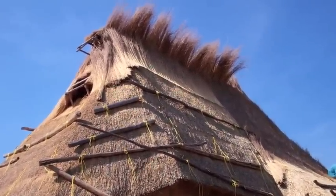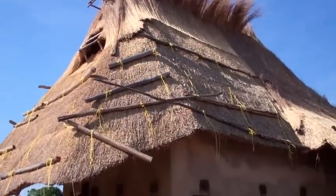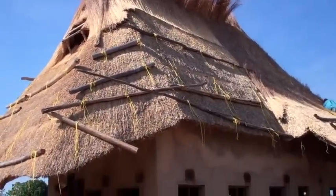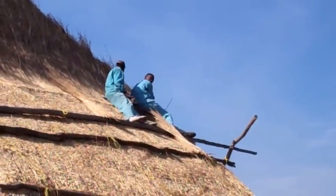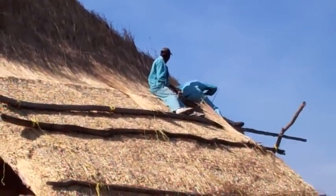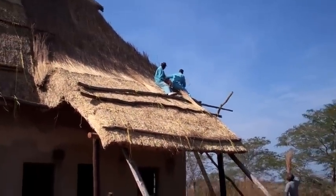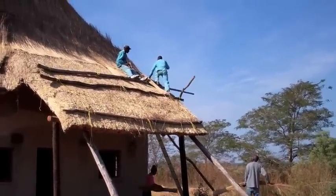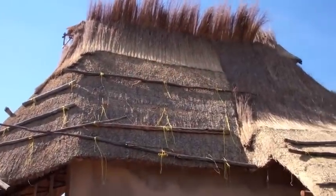The thatching is not clipped to look like this — it's actually pushed into place with a block of wood that's serrated to push the grass into position once it's tied down. It makes for a very tight roof and it also looks really nice. We can get 35 years out of a roof made out of thatch. When it starts going bad, we scrape off the rot and add two inches and it's ready again. A steep roof pitch helps shed the water quickly, and the tightness of the grass makes it work very well.